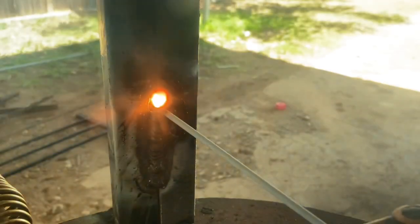I'm going to hold that puddle and do a little J-motion until it fills in. I'm not going to put too much heat or focus onto the left piece because it's hollow and it's already melted through, but you can always build around it. Check this out — look how it looks at the end.